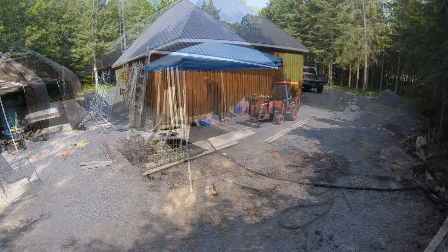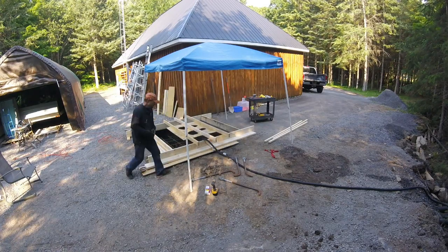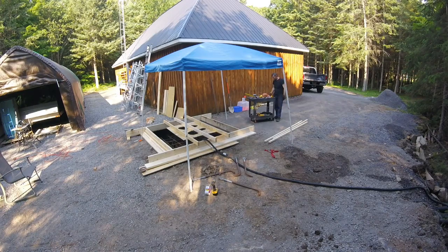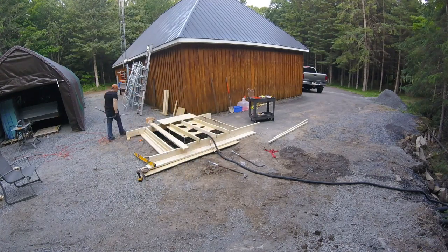Once that was located the next thing would be to build the form around it. You can see I've built the little walls and now I'm locating the top template. The top template — you see the plywood plate — is used to locate the J-bolts. You can see four of the J-bolts on the ground there and I'm just going around and bolting them to the upper side of the template using two nuts.